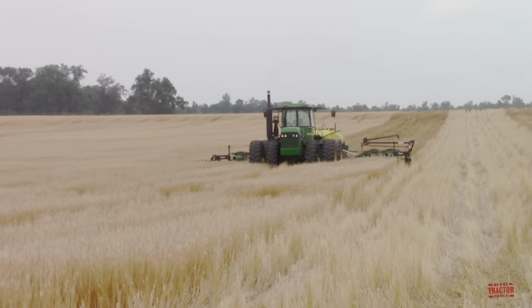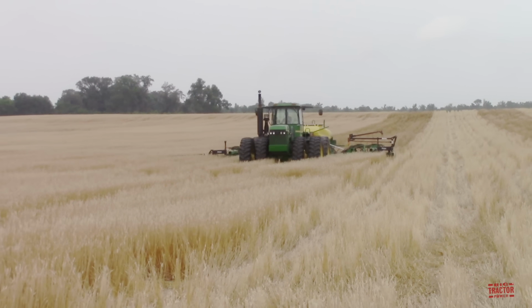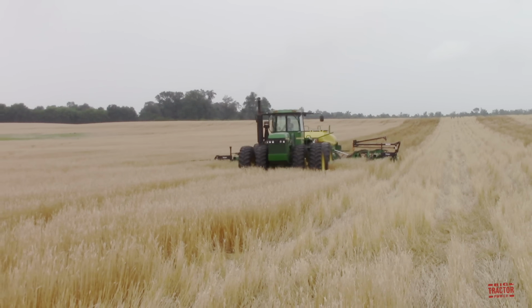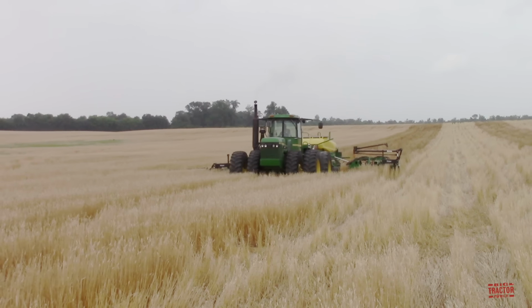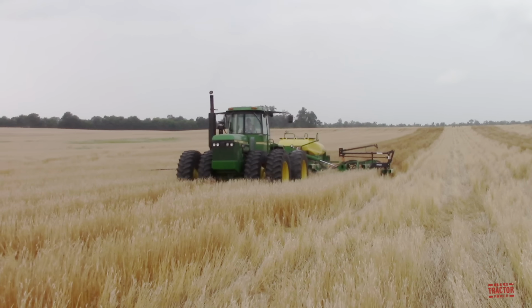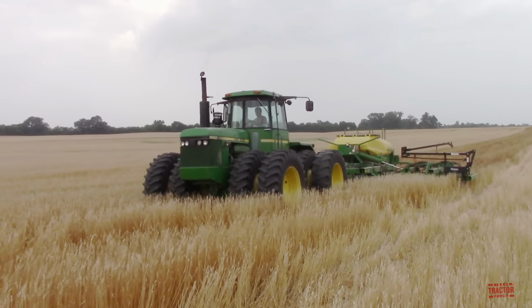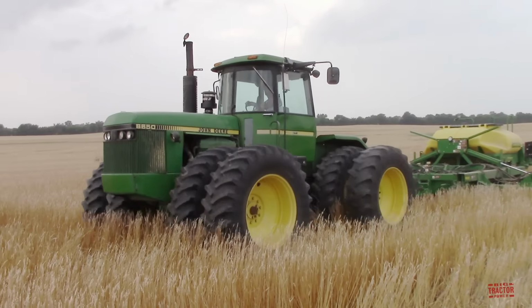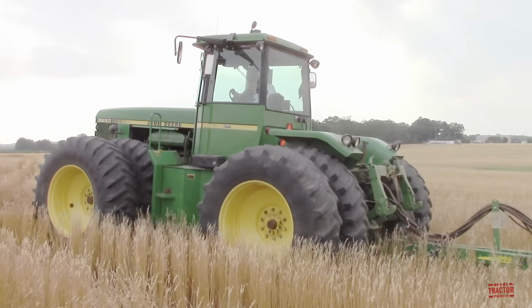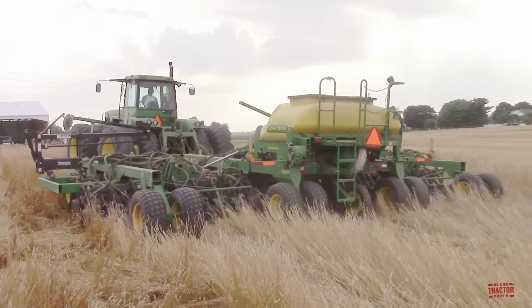John Deere replaced the Model 8640 in 1982 with an upgraded Model 8650. There were two key design changes made to the tractor. The first was removing the breather and muffler from the center of the tractor's hood and locating them over to the right-hand side of the cab for improved visibility from the operator station. Visibility was further improved by adding a set of headlights to the tractor's grille for better vision at night in the field. This tractor was manufactured through 1988 in Waterloo, Iowa at the company's tractor factory and is rated at 290 engine horsepower and 235 PTO horsepower.